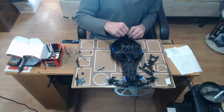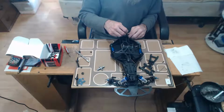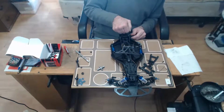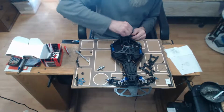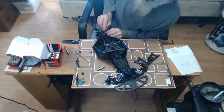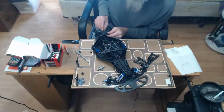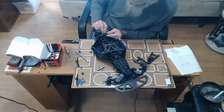Finish tightening down. Push this one up. Basically, I'm just going from side to side, and it's got two set screws, and make sure each one's well set and in place. And because it's nice and open, tighten them up a little bit. Shouldn't need much because I've got the Loctite on there. Even though it's dried up, it's still on there, and it should bite pretty good.